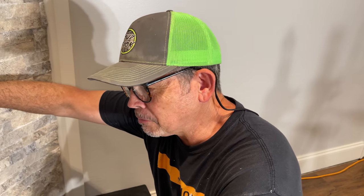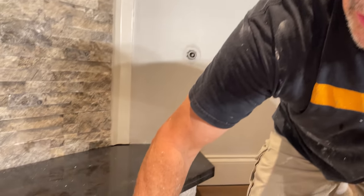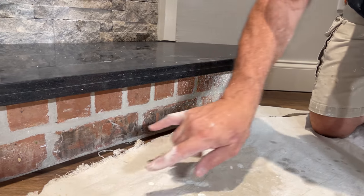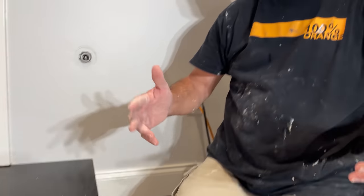Yeah, I like the bottom to top method way better. It was much easier. Those sticks were in our way when we were trying to put the thin set underneath them. So all that's left, gang, our final lap, is to put one course right here. We do have to rip them to 5 3/4 to get them in there. And then we have this 22 1/2 degree turn we're gonna make, and we're done. I'm gonna head out to the saw, rip those pieces, and Jordan's gonna install them. Let's do it.